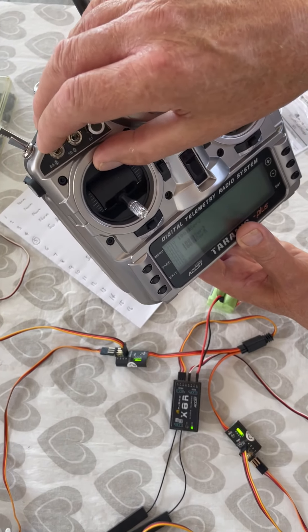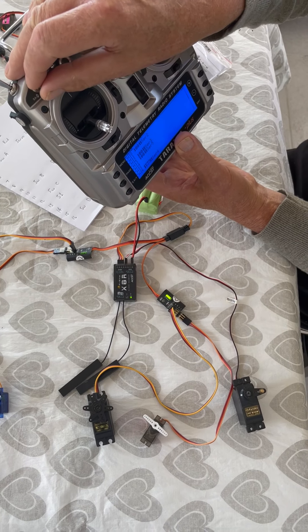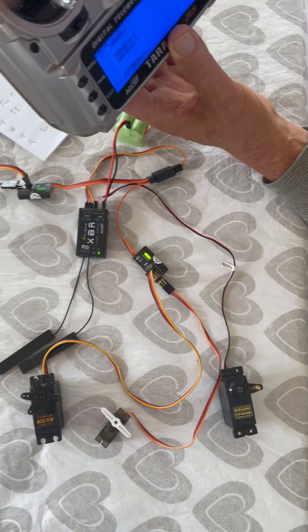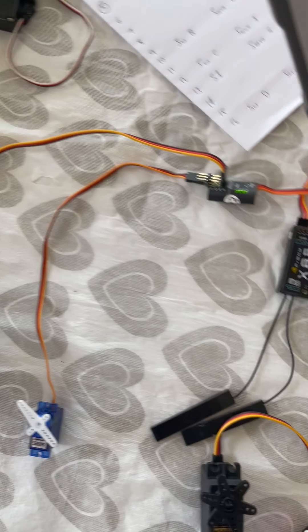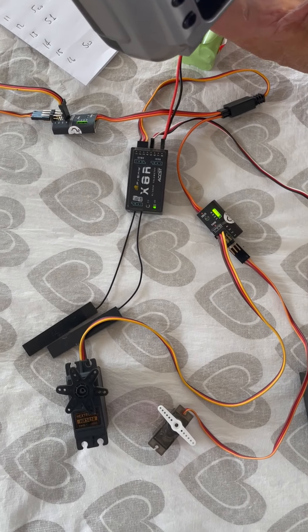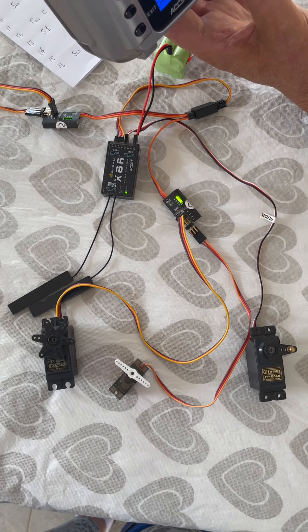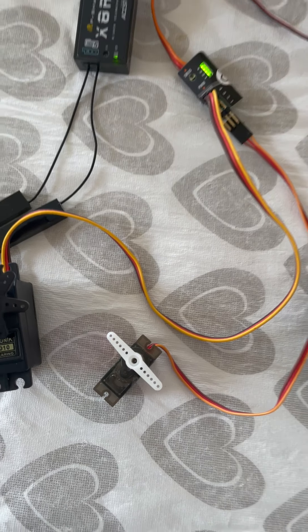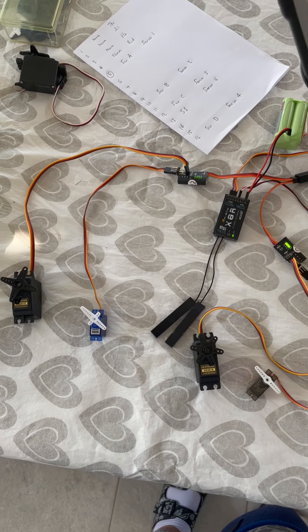So if I now operate the servos, you'll see down the row of servos there — that one's gone right to the end, middle central setting, so that's a full moving servo set in the middle. Same with this switch here, the other one over there moves. I can go to the channel — he works. Go to this one — he works. Go to the slider knob just to prove these work as well, and you'll see that I can get proportional movement on that servo as far as I like. So I can now program all 16 channels, and I've now got 16 channels as I wanted.